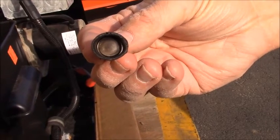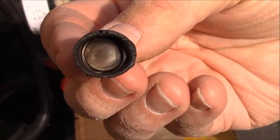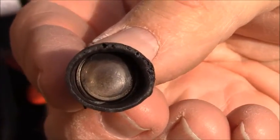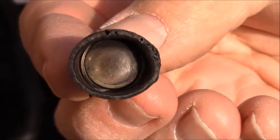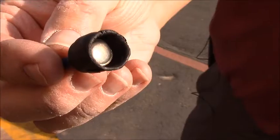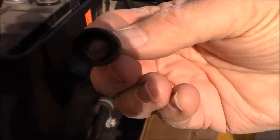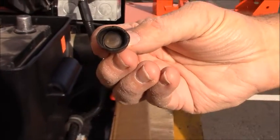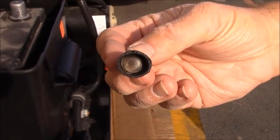Here's a picture of a really bad cat eye. As you can see, the whole front of it is really cloudy, and this burner probably was having a little back burn inside of it. The housing is melted a little bit, which tells us the burner was not functioning properly — possibly leaking fuel inside the burner and igniting it, which melted part of the housing.